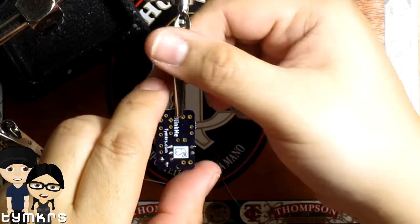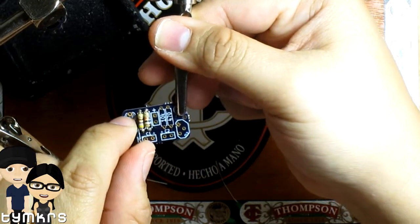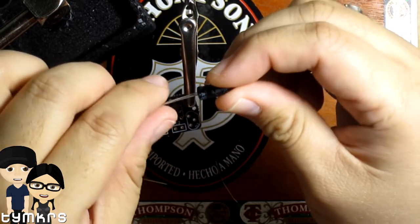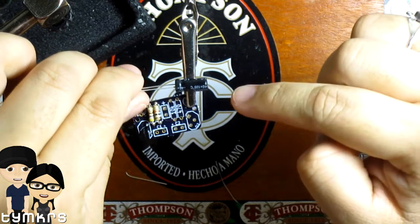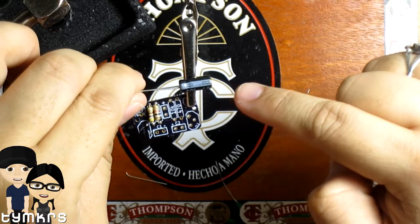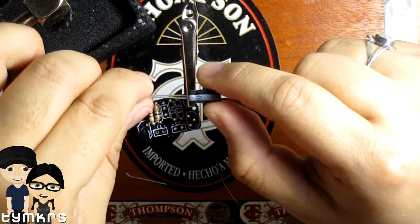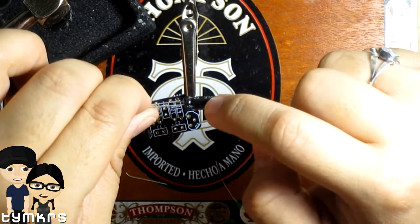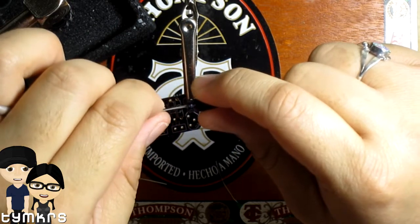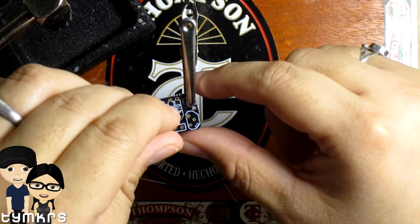Okay. And then we'll do the capacitor. And the capacitor, you'll notice that the plus sign is towards the center there. If you look at a normal capacitor, you've got one side that's usually got all of the details, and one side that's got a big old minus sign. You can assume that is the negative side, and this is the positive, otherwise known as cathode and anode. So anode is also A, cathode is C, in alphabetical order, positive, minus. So I'm going to put that in here.